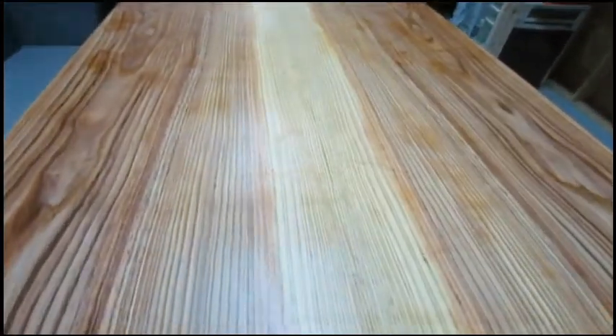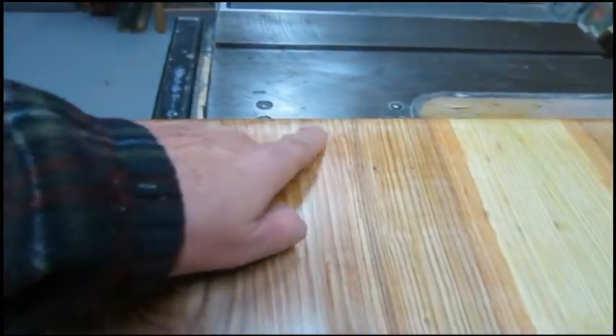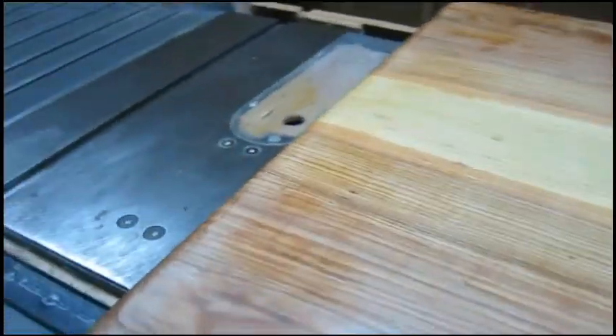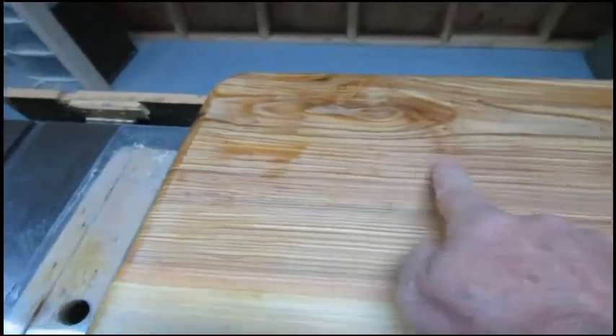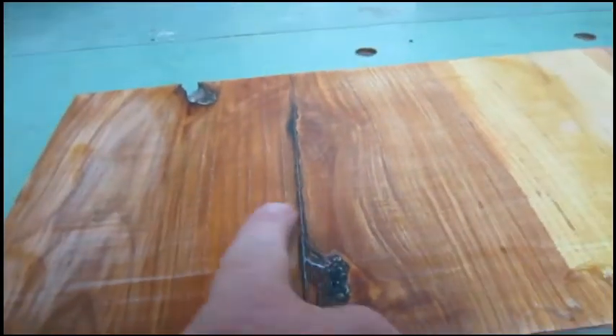Well, almost down to the end of what I was doing, and I don't like it. I don't know if the camera will pick this up, but there's a spot right there — you can see it looked like it sanded through a little bit, totally different color. I don't know if the wood was a little bit higher there or if the shellac was a little bit thinner. I've got spots like that — right in here — very splotchy it turned out. My test piece that I did before turned out great, but I'm not happy with this, not at all.